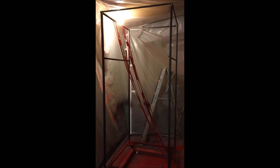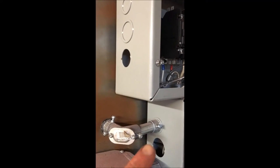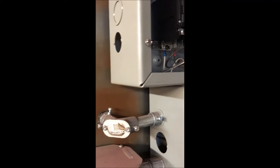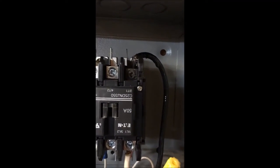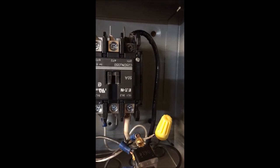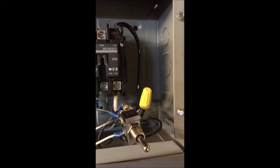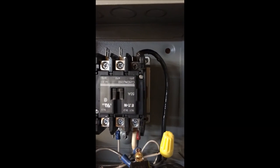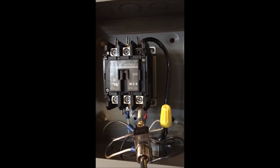I've got these all coated up and ready to go in the oven, but I came over to adjust the temperature and there was smoke pouring out of this hole here, which I assumed correctly is never a good sign. That terminal is pretty charred up, and I think it's six-gauge stranded wire — it's apparently not doing the trick, it's getting really hot. I'm concerned because I don't know why this hasn't happened before, so I'm worried that something else might be shorting out. The relay still seems to be working correctly, so I'll let you know what I figure out.